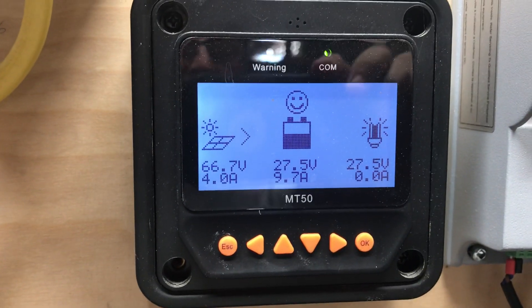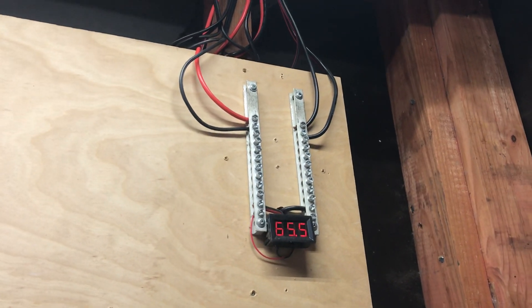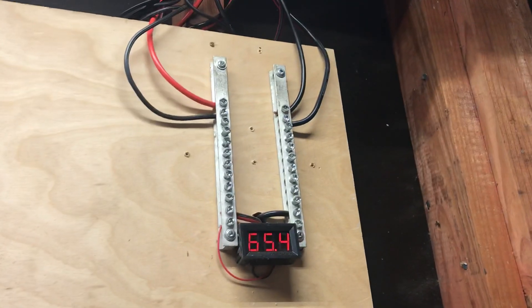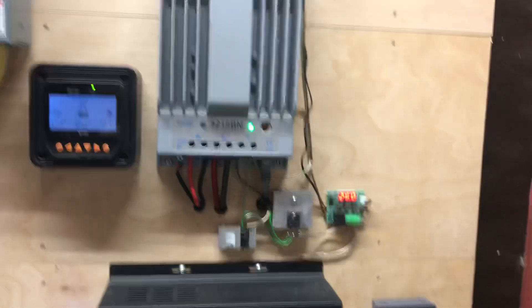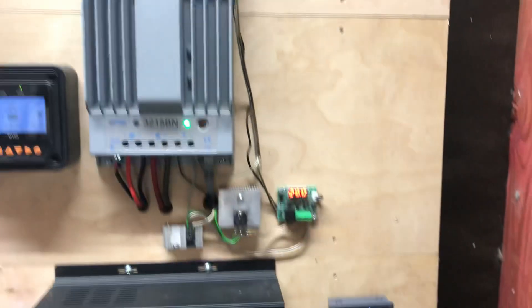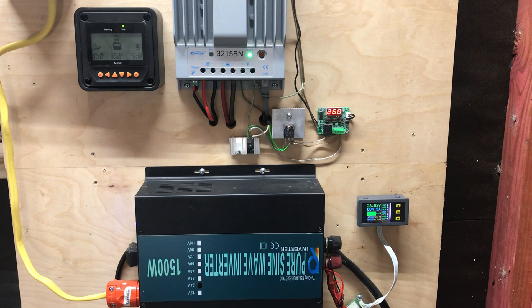It's usually in the 80s — about 82 or 83 volts — when there's no draw on the panels, and that's why I have it way up there. I don't like to get anywhere near it at that kind of voltage. Before when it was 12 volts you could put your hands all over it, but at this voltage I should really have it in a box — something I'll do in the future — just to keep it safe in case something crawls across it at night, like a lizard. Anyway, the whole video was just to show this thermostat upgrade. Get two on Amazon for about eight bucks. Hope everybody's safe out there — have a great day, and as always, thanks for watching.